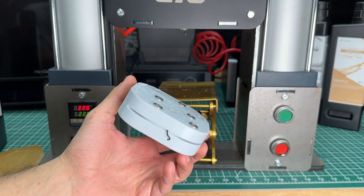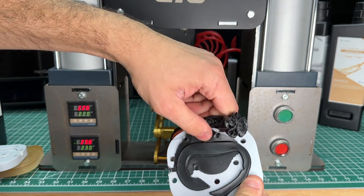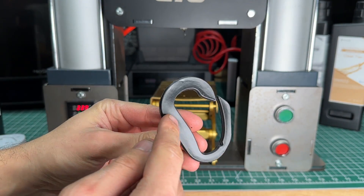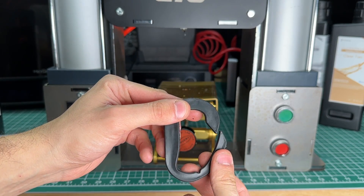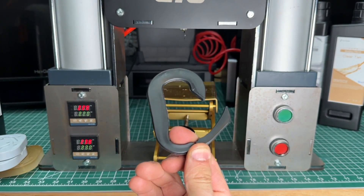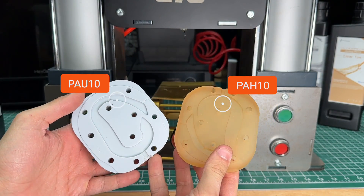I could seal the cavity a little better, so there are two design flaws: one, make the vent hole bigger; two, maybe add another screw somewhere. But let's open this up and see if the concept works. I stick a screwdriver into the pry slots and open it — not terrible. I pull the part out, clean the flash with a razor blade, and there's our carabiner. It looks pretty good and picked up nice detail from the molds. Next time I'll probably add our logo. The ABS plastic is a little too rigid though — we need something more flexible, and perhaps a design change. So instead of changing the molds, I'm going to try a more flexible plastic with our other molds and compare how the two resins hold up under injection.